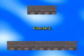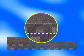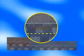Trim 6 inches from the first shingle of the second course. Place the butt of the shingle at the top of the dragon teeth of the underlying shingle. 5 inches of the underlying shingle should be exposed on these English dimension shingles. Full shingles are then placed across the roof to complete the course.